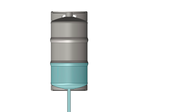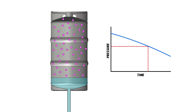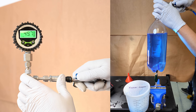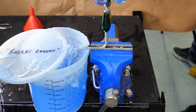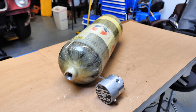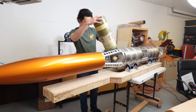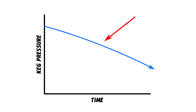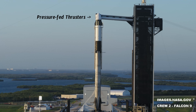With our isolated propellant feed system, more gas space means we get a more stable feed pressure and flow rate going out to our rocket engine. This is a type of pressure feed system specifically configured to operate in what's called blowdown mode — classified as blowdown because there's a constant number of gas molecules in each tank that lose pressure, or blow down, as it expands out to feed the engine. But if you want a stable flow rate, why not just continuously feed the tank with pressure? Well, we could put a separate tank somewhere onboard the rocket that continuously pressurizes the tanks in flight, but for our rocket that's a whole bunch more complexity, weight, and failure points that really isn't value-added based on the level of performance that we need. The only extra complication is that we'll have to design our rocket engine to handle the decaying feed pressure. So by using all this extra space in our tanks, we can build a rocket that's ultimately simpler, more reliable, and less expensive.